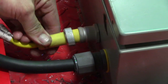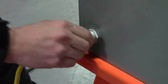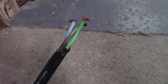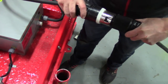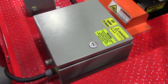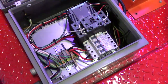Once all of the spreader bars are attached, it is time to hook up the control panel. Attach the control cable on the electrical box and run it to the control panel which will be near the fence line. Connect the control cable to the control panel. Next, you'll need to hook up the power to the ride. When you first get your ride, you will notice that the power cord comes with bare pigtails. It is recommended to use 50 amp service only to power the ride. You can use many different types of 50 amp plugs — shown here is a 50 amp twist lock plug which is commonly used on large tow-behind generators. To turn on the power to the ride, open up the electrical box at the front of the ride using a flathead screwdriver or something similar. Turn on each circuit breaker one at a time and then lock up the box.